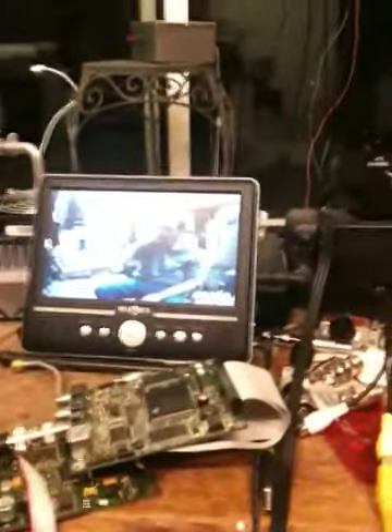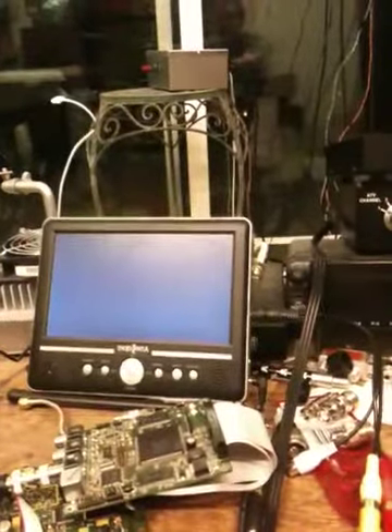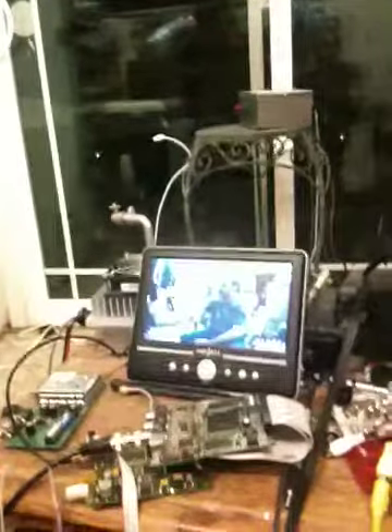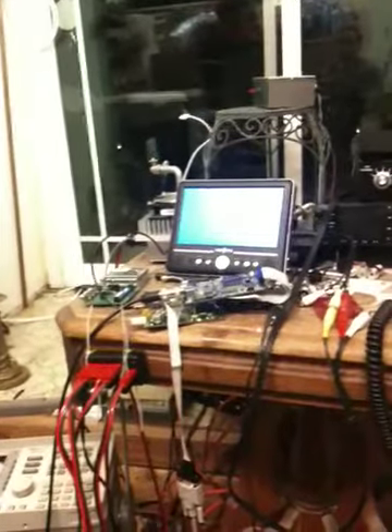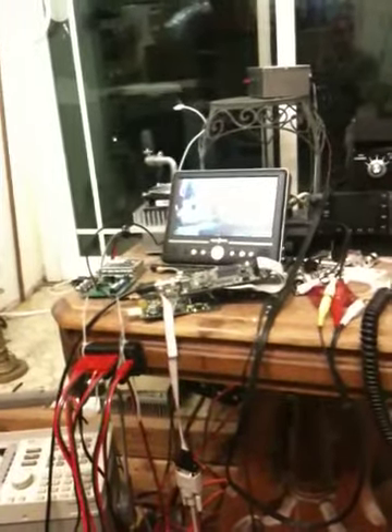You can see it's digital because as I move my arm down, after about a one or two second delay, the same thing happens on the picture — that sort of proves it. Digital TV is never perfect. As I move my arm around, it creates different multipath environments in here. If I move my hand in front of the iPhone camera, you can see what the delay is. So that's a full round trip from analog camera to DVB-S, up on 1.2 GHz, retransmitted by the repeater on 900 MHz with 8VSB ATSC, then down-converted and received on a regular television.